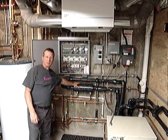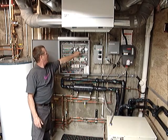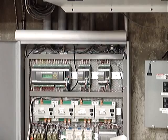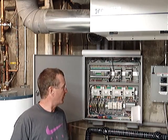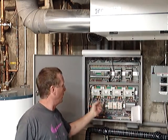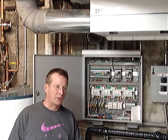We're putting maybe 7,000 to 8,000 BTU an hour back into the ground through this heat exchanger. Up here we see a DDC control, a series of transformers, and a few other smaller input controls. This is a control primarily used for building automation on high-rise projects — schools, hotels, hospitals, anything with multiple air handlers. We use it because of its capability of accepting up to 20 different sensor inputs, up to 20 switched outputs, and variable voltage outputs that come in handy for managing HVAC equipment.